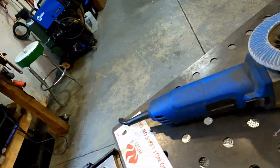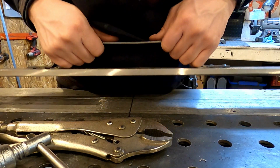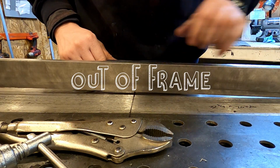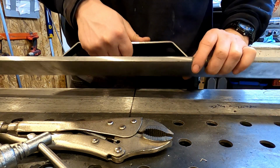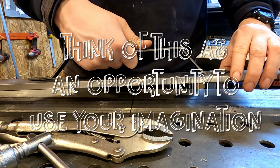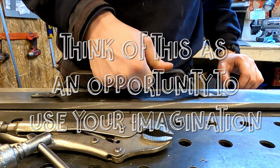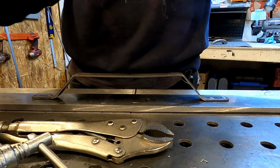But the best detail is this. When I lift up, you'll see these pins here and here. So now you don't have to line up this top bar. The pins are self-aligning. So all you do is lift this up a hair, slide your work under there, drop it, and clamp it.